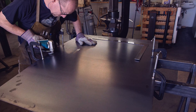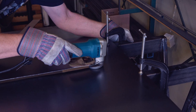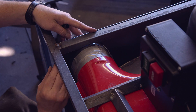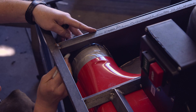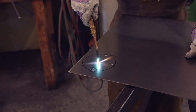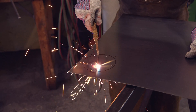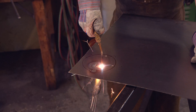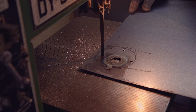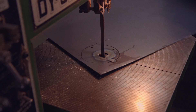It's time to cut the sheet metal again and it's not getting any easier — the plasma cutter sure would be nice. In the first episode, cutting a circular hole with a nibbler was not that easy either. I thought I would experiment with a cutting torch but I think I am not doing that quite right. The challenge is that the cutting torch was raising the seam and the nibbler would no longer be able to cut, so I need to create some working space with a bandsaw first.